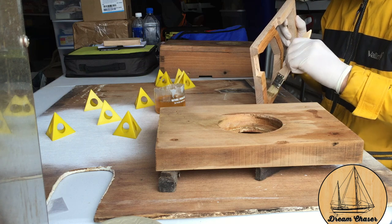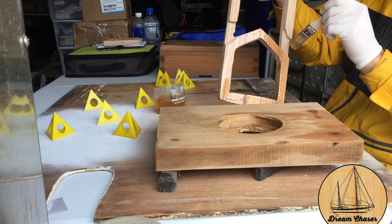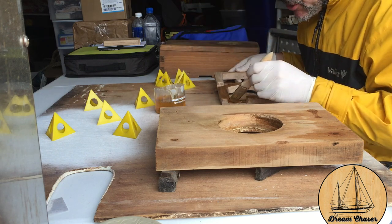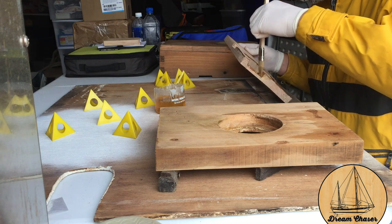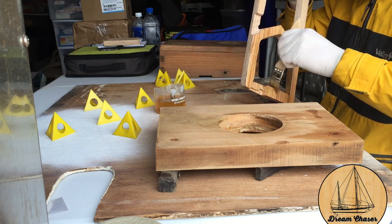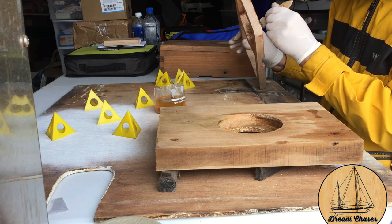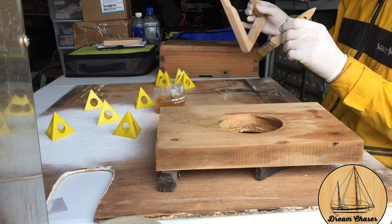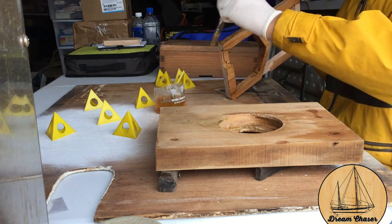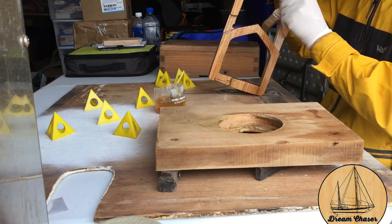I definitely want to do the inside portions of this — not so much on the outer side, but definitely on this side where water is going to come in the cowl vent. This will be the channel that runs the water out to the sides. I'm going to put it on a little thicker here where I've done the cutting and routing, just to make sure those small cut areas aren't ingress points for water. These spots that are end grain definitely soak it up a little bit more, so put it on thicker there and let it soak into all those capillaries. I'm doing a light tipping just to keep it fairly smooth. It'll be covered with butyl tape on this side face-down on the deck, but I want it to look good — practice for the Dorado box itself coming up.